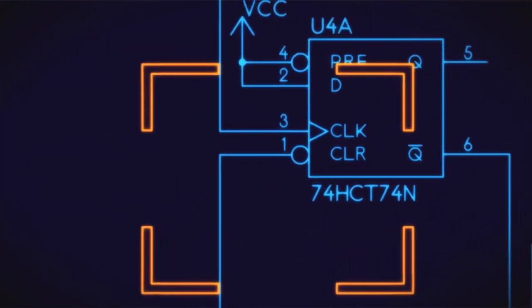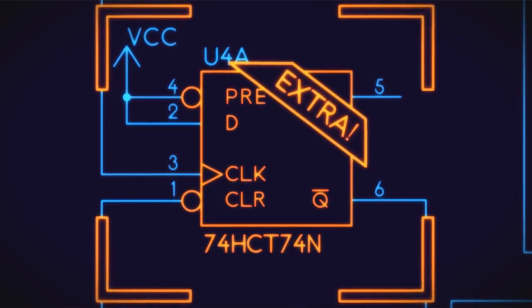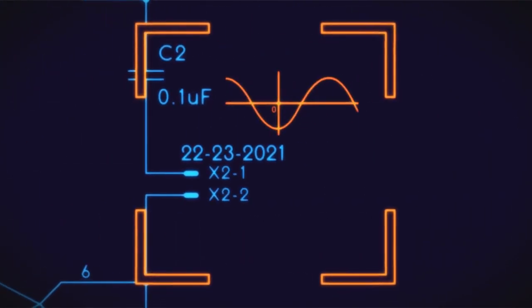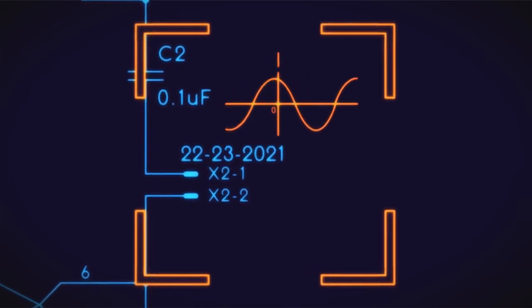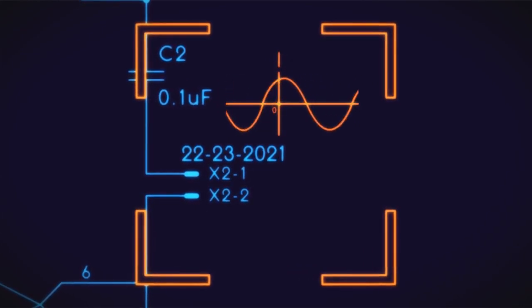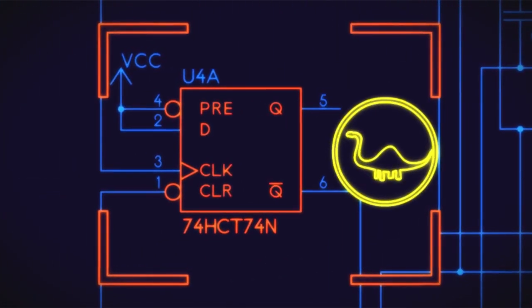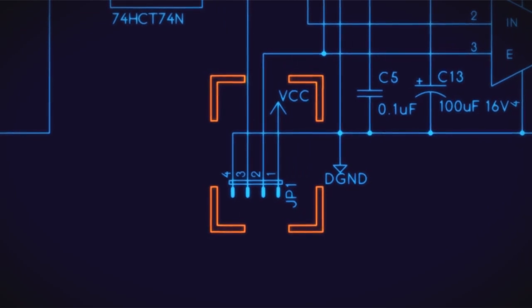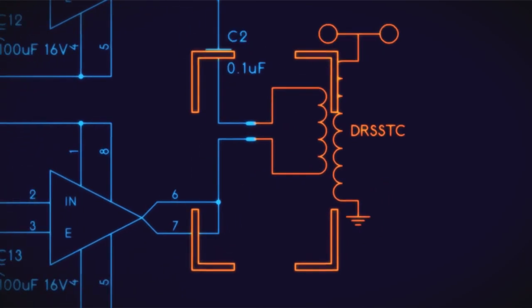We feed into a flip-flop. This is in addition to the basic solid-state Tesla coil schematics. This makes sure that when you transition your gate driver transformer, you're turning it on or off at a zero cross, so there's no stray energy floating around. It's another safety device. It protects the circuits.